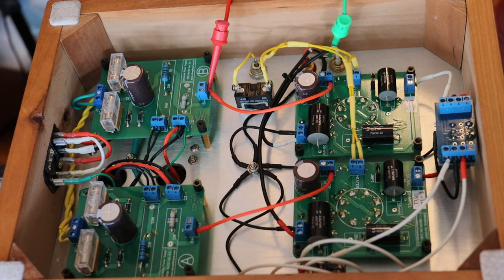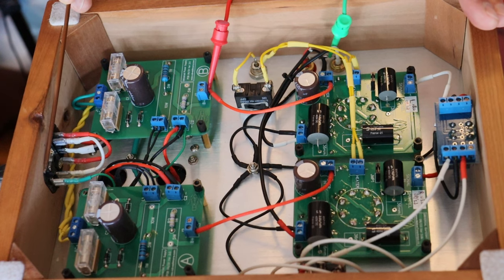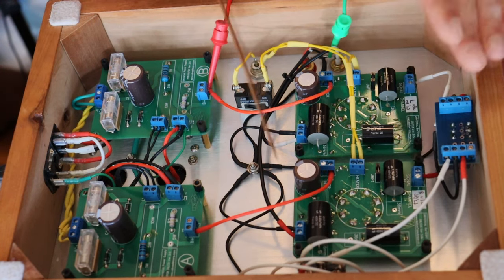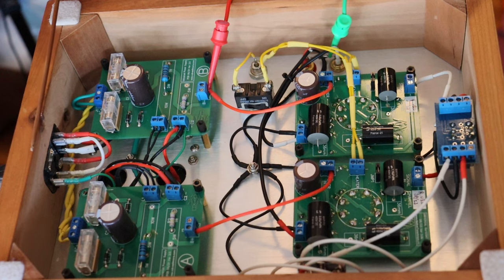We're taking a separate recording and I'll overlay them here in a bit. We've set the meters up so they're ready to capture the maximum surge in voltage and in current. You'll see on each screen that one is set up for DC voltage — that's what basically every amplifier runs on. You supply AC mains, but then you rectify it into DC. It doesn't matter whether it's a solid state amp or a tube amp, your circuit actually runs on DC. You're also going to see one of the meters set for ACA — AC amps — which is our mains power supply on the IEC cord.